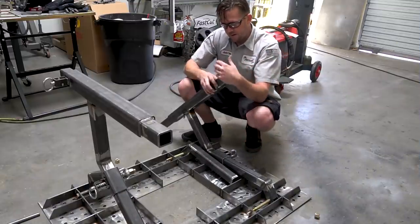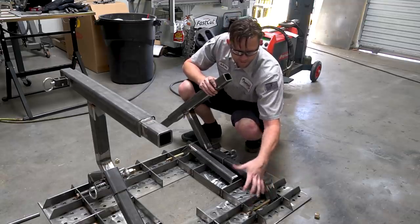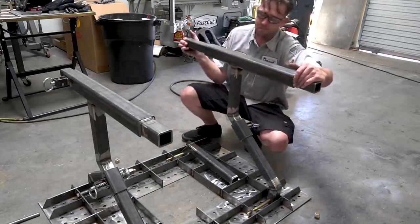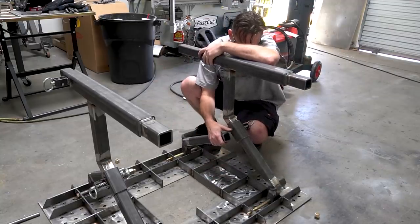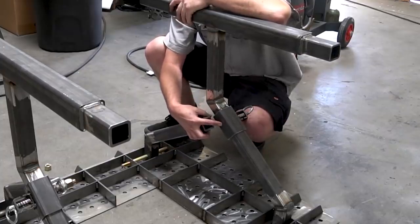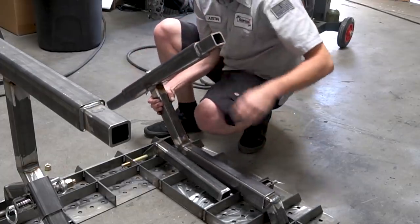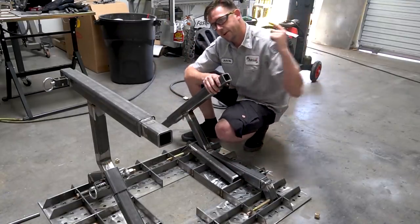Okay, table on the floor, obviously, legs in place where they need to be. I do have to cut up some spacers here to make sure that they sit in the same place where they're supposed to be, but I need to have all of this together so I can measure all of it out. Now, this beefy, super hardcore table leg setup here will essentially fold. I have a heim joint that I'm gonna put on this end over here, and then when we pull the pin, let me see if I can do this by hand here, there we go. When I pull the pin, that sleeve will slide down, this whole assembly folds up, and then that means the tabletop will fold up and we can get it through that door.